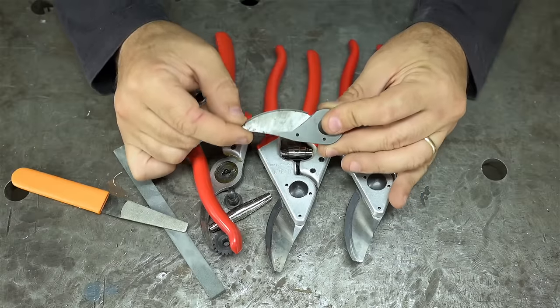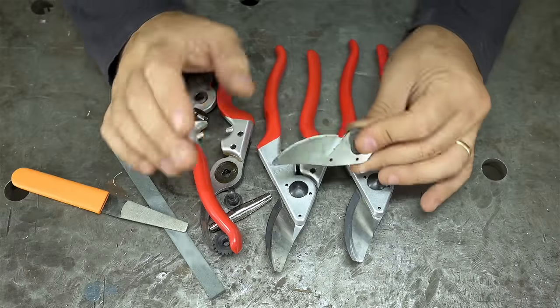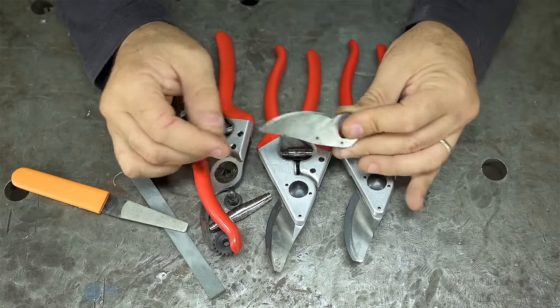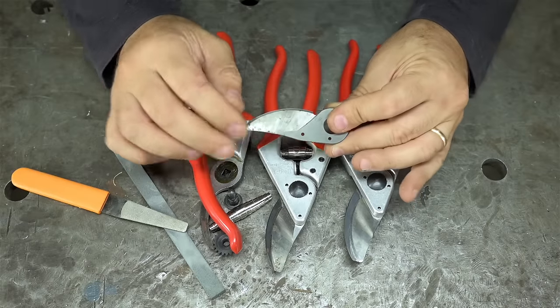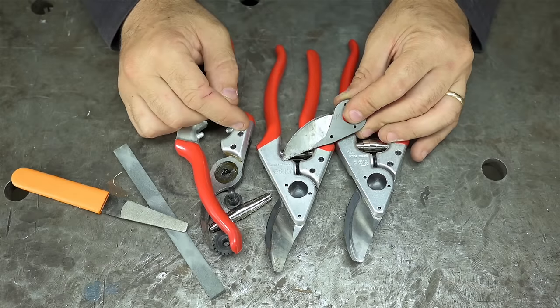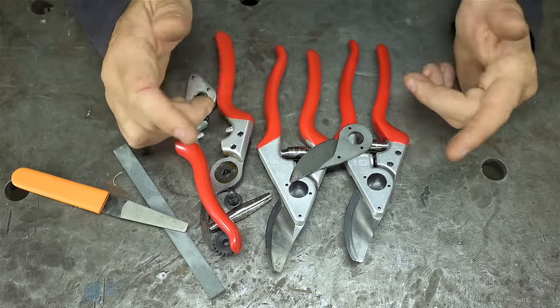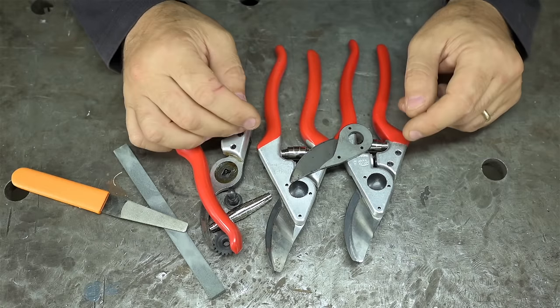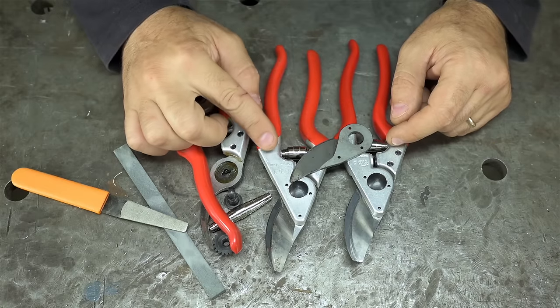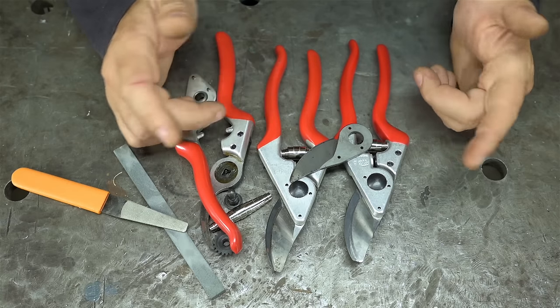But how a person would hold a consistent 23 degree angle on a curved cutting tool is a whole other story. Maybe not an important story, sure, but another story nonetheless. For my jig, I'll start at 22.5 degrees. We'll test the jig against these bevels. We'll use some Sharpie, see how close we get. But as in most things, consistency front to back is probably more important than whatever the actual angle is anyway.